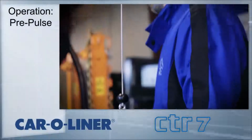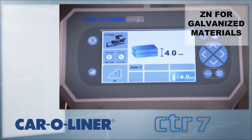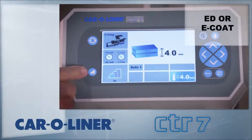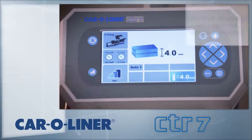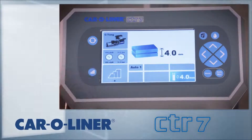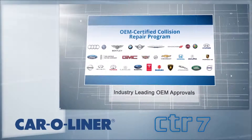The CTR-7 has three pre-pulse modes for different materials. Pre-pulsing helps the welder establish an electrical connection between the layers. The button located on the left side of the screen allows you to cycle through the options. The first option, ZN, is for zinc-coated or galvanized parts. ED is for cases where there is a factory E-coat, primarily on the inner surfaces. ED-plus is used when there are multiple layers of E-coat or for weld bonding. The pre-pulse can also be turned off. Always refer to your OEM procedures for proper preparation prior to welding.